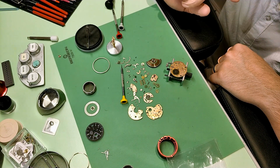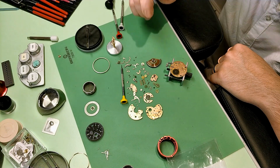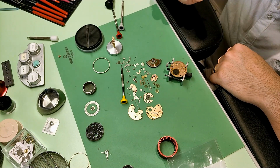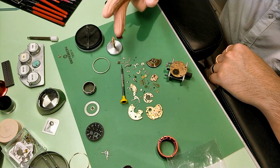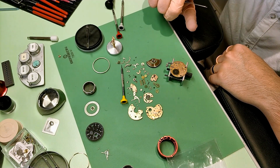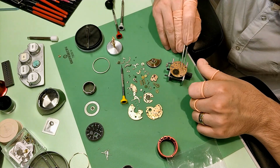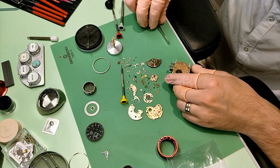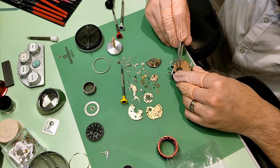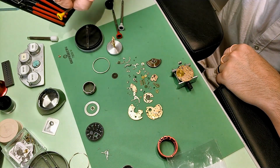Then after I'm going to fully wind the watch. Then 24 hours later, right on the dot, I'm going to see if the watch is still keeping time on the right when I set it up the first time. If it doesn't, then I've got an issue, and I'm going to have to rework it. So the watch has been tested at least 3 or 4 times before we let it go. It's essential to make sure it's all done properly.